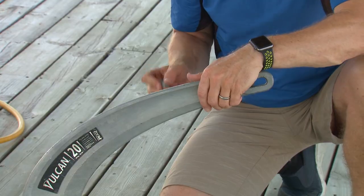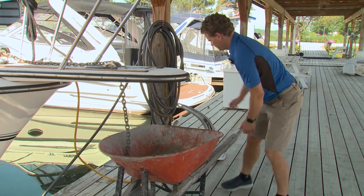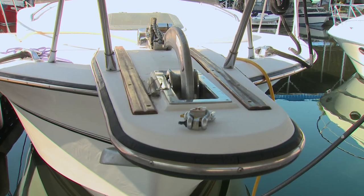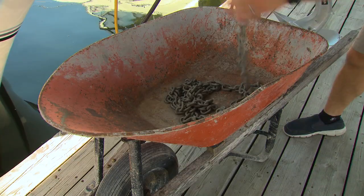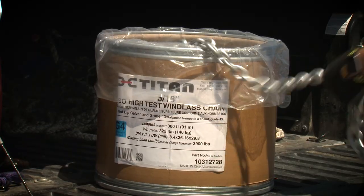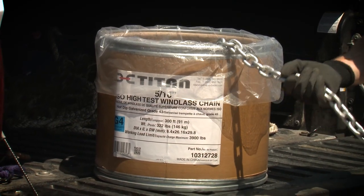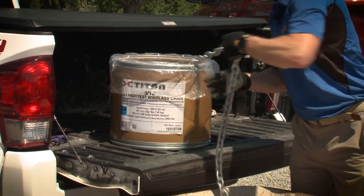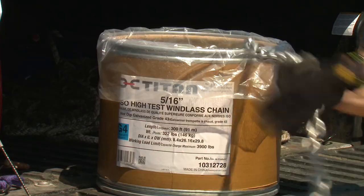To make life easy, we've borrowed a wheelbarrow to stack all this chain and rode into. The nylon is pretty tough, but over time it can get a bit moldy. If you notice a funny smell coming from the anchor locker, you've just discovered another benefit of all-chain rode, especially if your anchor locker adjoins a stateroom. The chain weighs over 300 pounds, so we've got a little fandangling to do. This is galvanized 5/16ths — hot-dipped galvanized — but you're still going to get a bit on your hands, so some gloves just help keep your hands clean while you're handling all that chain.